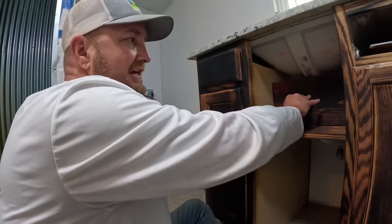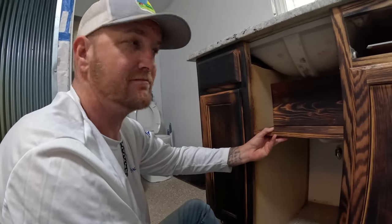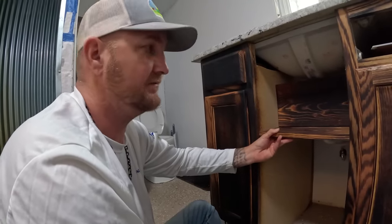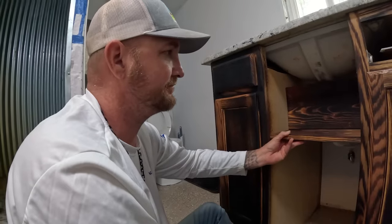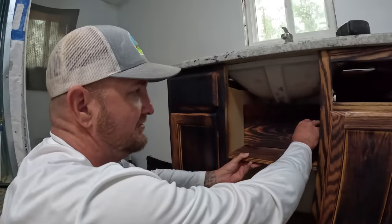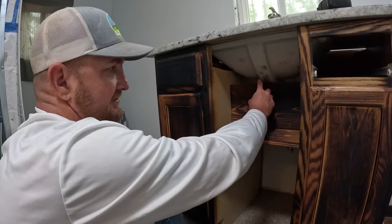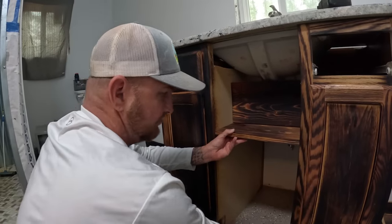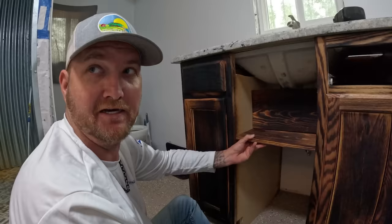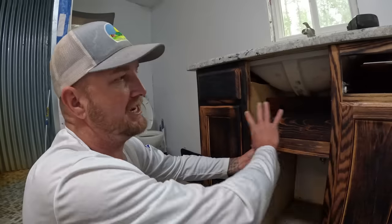And have metal backing. What a nice shelf. Okay, yeah, I'm picking that up now. So you would just screw the metal into the wood? Yeah, just put one here, screw it into each side there, right where this one is. Do another one in the middle and one at the bottom, and then cut a piece to go perfectly in there.